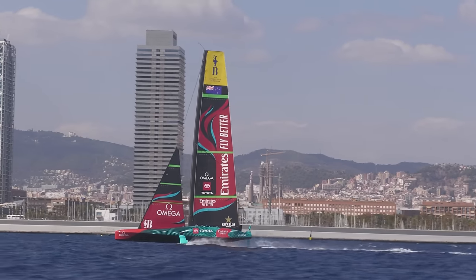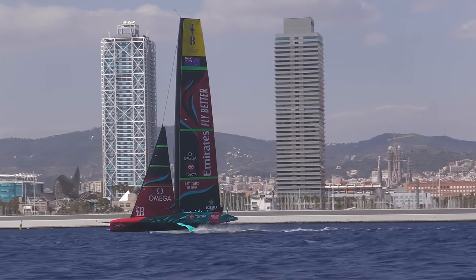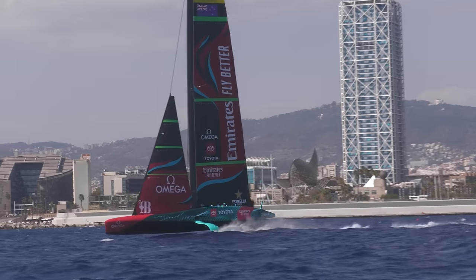It's not going to be a question of whether people have bustles — it's going to be a question of what those bustles look like. A bustle is great for takeoff: it balances lift from the foil against buoyancy from the bustle. But if you can essentially tow the boat up on the foil and foil the whole race without ever touching down, you might start looking at a bustle design much more focused on how easily it can pass through waves without slowing the boat down. That might be an area where teams go in different directions.